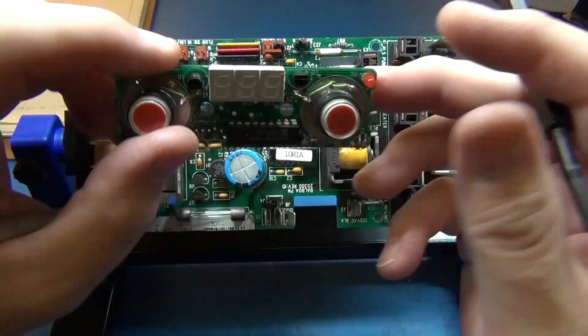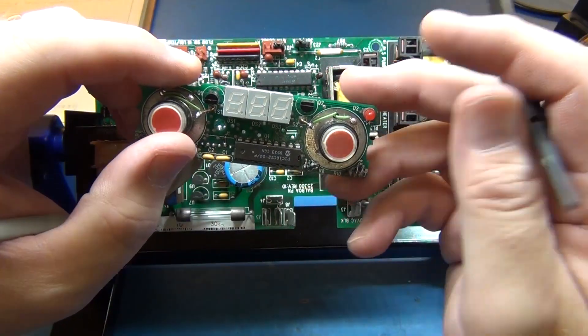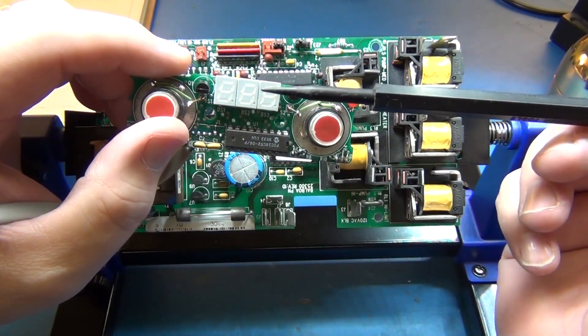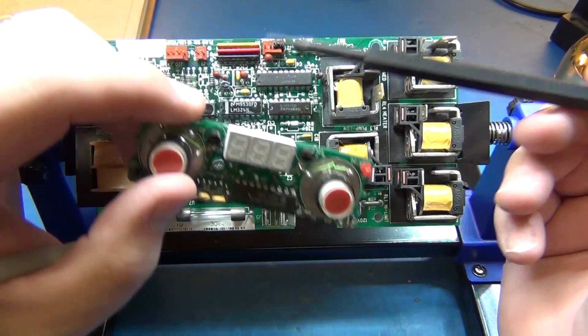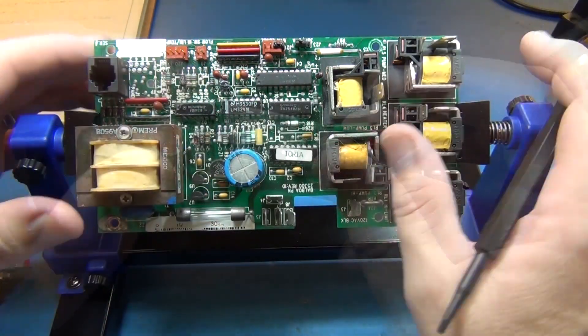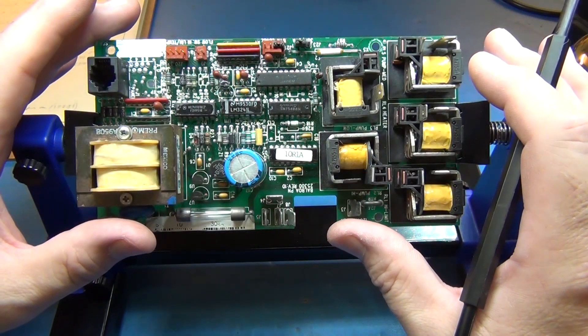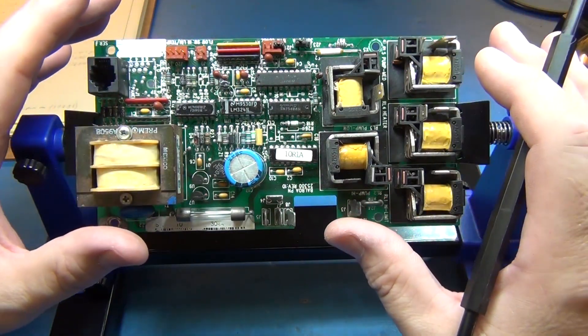If the micro on this board is going to ignore these button presses, you can't change the temperature anymore, and you can't turn the jets high and low because that signal is being ignored by the micro as well. So not a lot to discuss here other than what does this board do and how can we replace it.